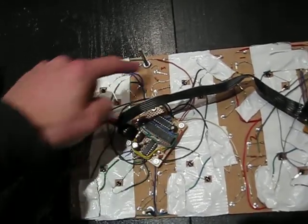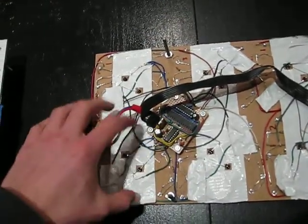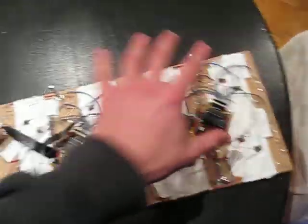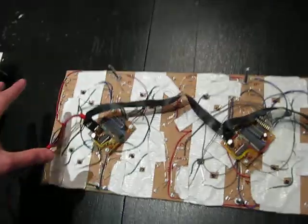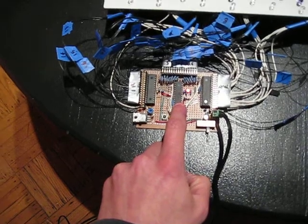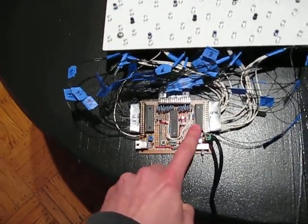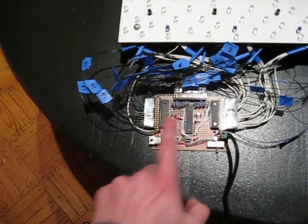You can see there are four pixels here, four sets of sensors, for one controller. So three controller boards for three modules, four pixels each. Whereas this new one uses pretty much the same controller but with two TLC5940 LED drivers.